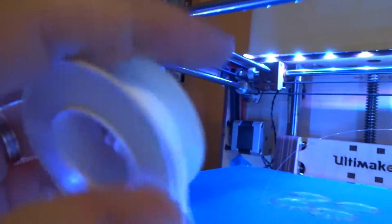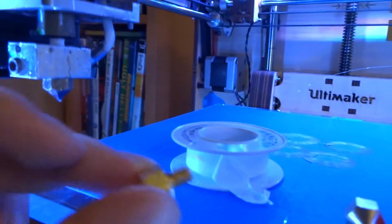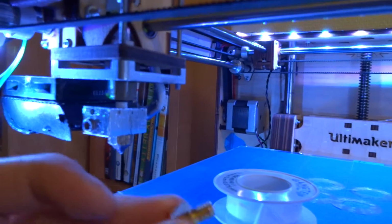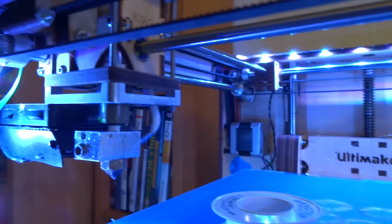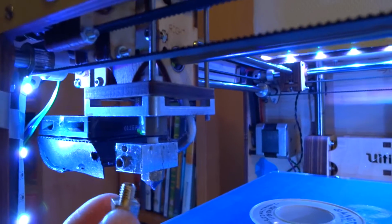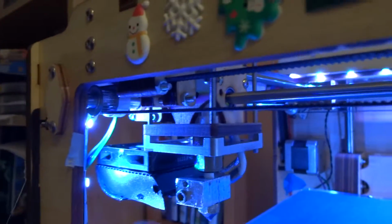and just run this along the threads of whatever you're gonna thread in there from the nozzles. And you can be quite liberal with it. It doesn't really matter. Just use more than you think, because if you use less, this will happen. You will have a leakage instantaneously. But use more than you think. And also, when you apply the thread sealant, apply it so when you tighten the nut up, it also tightens the thread sealant up. You get my drift? So the end of the thread tape should be so when you turn it, it follows the threads. It doesn't go against the threads.